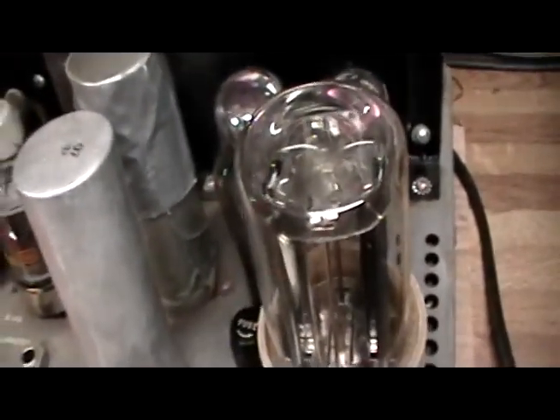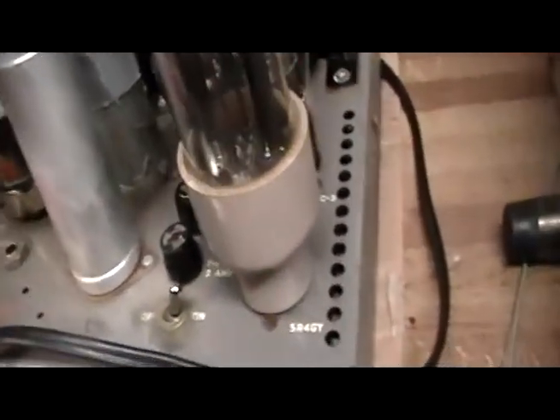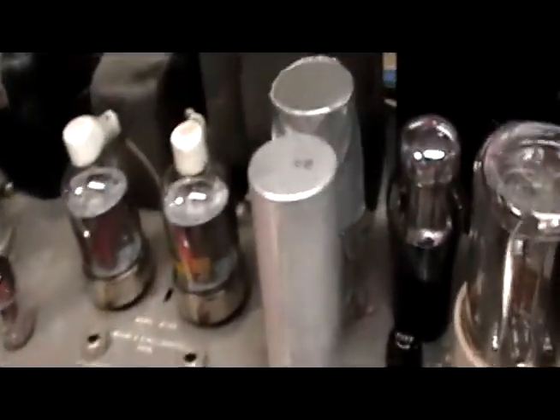It could be a very dangerous situation. One other thing that's very important — you'll see this cap right here. It's got duct tape over it, but on this side it's got the original insulation. Unlike this capacitor package where the case is electrically grounded to the chassis, this one is not. So it's literally hot compared to the chassis. If yours doesn't have the original coating on it, you're going to want to slip something over it. Someone did a very interesting duct tape job — it may not be the prettiest, but it has definitely made it a little safer to work with.